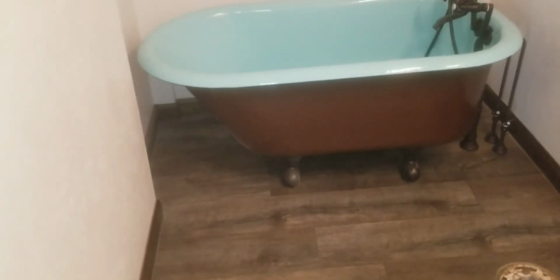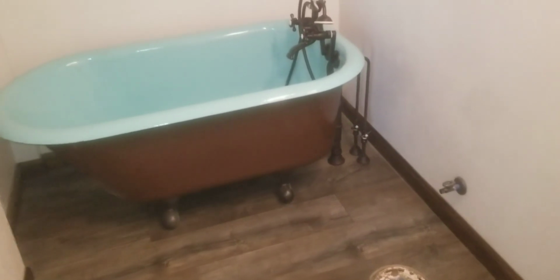Yep, I'm going to go ahead and throw in the toilet right now. I got a new ring for it, and I got parts for the water. Going to probably fire off the well tomorrow, run a bunch of bleach through it before it hits the house. And then I've got that faucet that I hooked up right at the well, so I can take out all that crappy water without having it go through all the lines. So anyway, let's get the toilet in here.